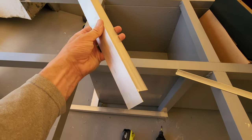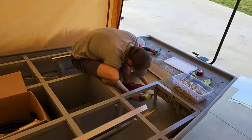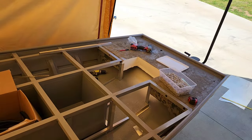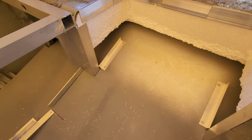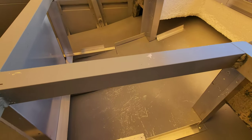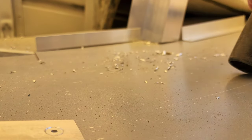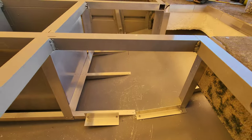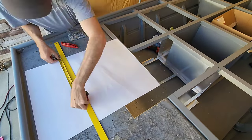This is where three batteries would go, and I wanted to build a flat platform for them to mount. I got creative with some framing and spec'd out a flat space for the batteries. It's important to note that I kept in mind the battery's dimensions and height to ensure proper clearance from the hatch lid or the recessed tray going inside the lid. Not only did I frame the battery flat, but I had to add framing around the vertical perimeters and corners for the hatch walls to attach to.